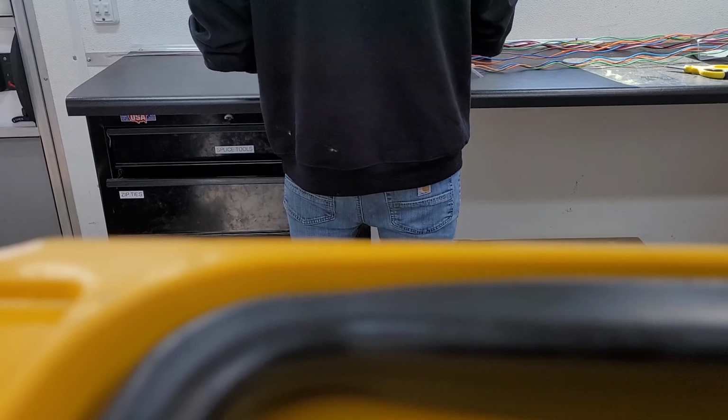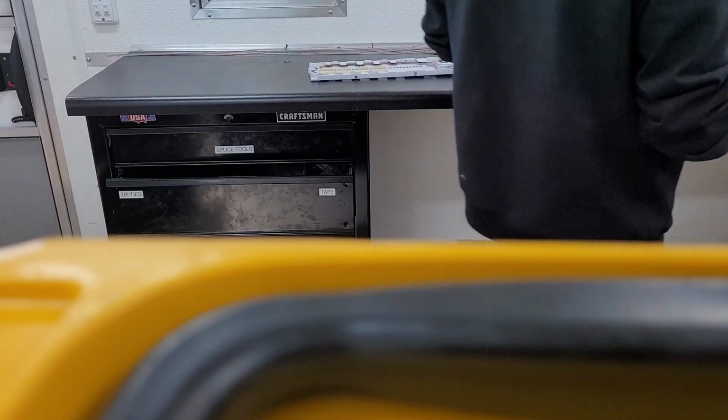It can sometimes make it easier. If you're going for low loss, I wouldn't recommend it, because now you've got two splices in one tray and one fiber right next to each other, which increases the loss. But depending on your network, that's not going to matter. Ours, it's not going to matter. Somebody else's, yeah, it possibly could matter. And anytime you have splitters and stuff like that, it doesn't have as much of a budget for loss.